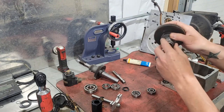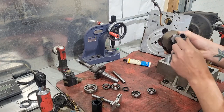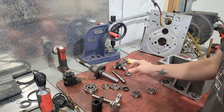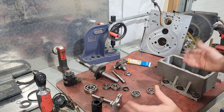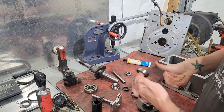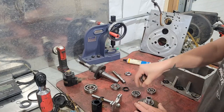Same with this primary drive gear — this is a nylon locking nut so you do have to inspect that. You have to clean these really well; this is very fine thread and you can easily cross-thread it. Before we assemble this we're going to go through with a thread file and make sure we don't cross-thread it, because if that doesn't lock, that's it. What sits on this surface is the smaller bearing here — this one actually sounds pretty decent but we're going to replace them all.